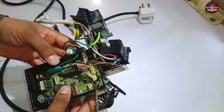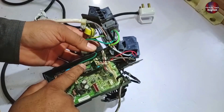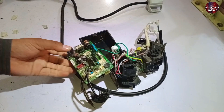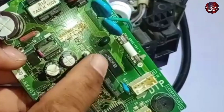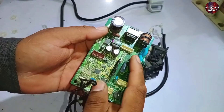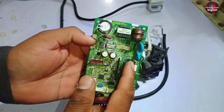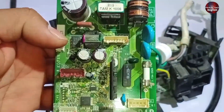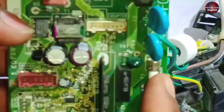If you encounter such a problem, first check both fuses if the unit is completely not turning on. After checking the fuses, the next step is to look at what other issues could arise. Next to the fuse, there is a ZNR. If the voltage goes above 250 volts, the ZNR can short circuit. If it does short out, it will protect the rest of the unit by burning itself out along with the fuse, or the second fuse connected to the neutral line might blow as well. So both fuses have the potential to burn out.